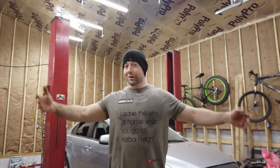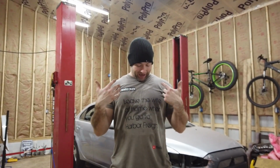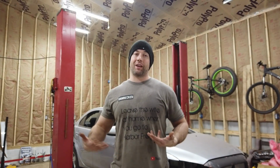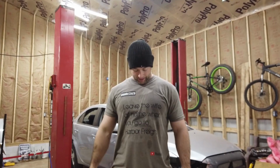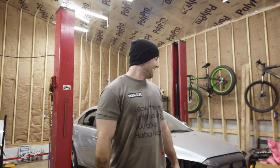Sorry guys, but I'm going to call it right here. I missed some good footage. If you haven't noticed, my brand new shirt is covered in automatic transmission fluid. When I was bleeding the cylinders, I kept getting air out of that one, and I kept cracking it, kept getting air, and I thought, I'm going to run the pump while I have it cracked a little bit, so it'll push even more air out. So I hit the pump button and it just shot everywhere. So don't do that.